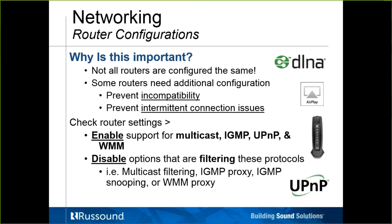The other thing is, when ISPs put out firmware updates in the middle of the night, they don't let anybody know. They just push a firmware update to an ISP modem-router, and it's going to end up resetting the router and usually undoing setting changes that you had to go in and make the first time around to get it working. For example, say they have a Verizon Actiontec router. You went in, you undid the IGMP proxy, and everything starts working fine.